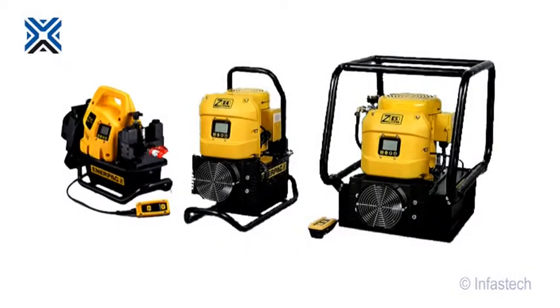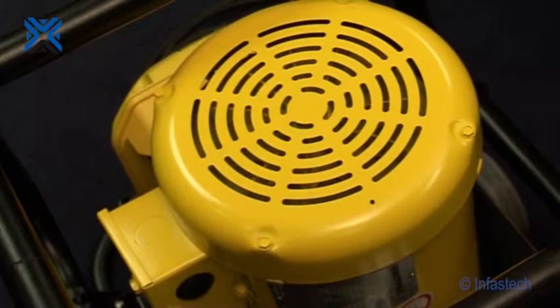The Enerpac hydraulic power unit is a high performance custom Enerpac pump unit, portable and robust design with proven reliability. It has a high efficient two stage pump for increased oil flow rate and bypass pressure, with 18% less current draw than comparable pumps. A range of powerful universal industrial electric motors, which are fully enclosed and fan cooled for high durability and extended working life.